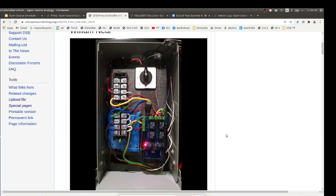The short answer to your question about weatherproofing: the hydraulic solenoids are all waterproof. The really good thing about hydraulics is they're extremely robust. They're all enclosed, the fluid is inside, and it's self-lubricating. It's not like an electric motor, where you'd better make sure it's a waterproofed electric motor. Here, dirt and water do not matter, because hydraulic equipment is typically designed for that kind of environment. Heavy machines work in the dirt, dust and elements. They have rubber seals around all the shafts, and the hoses are self-contained, otherwise fluid would be leaking out. So by definition, hydraulic systems are watertight.